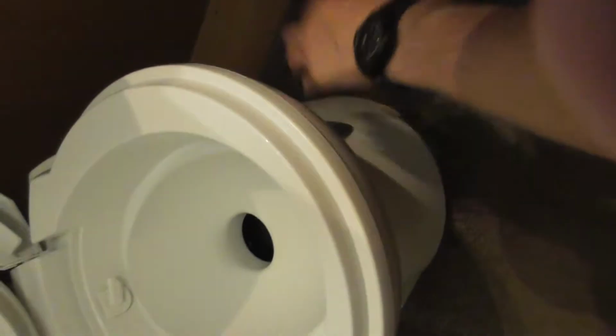If I slide that across, that should be open now. Yeah. So it needs to be in that closed position to pull the waste tank out. Closed for waste tank out. Yeah. Open to use it. So use it, flush it, and then close it back up again. So you obviously keep the smell out then. Okay. Right. Obviously there's not a huge amount that's too complicated.